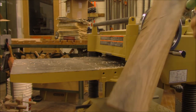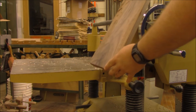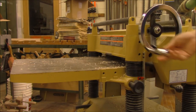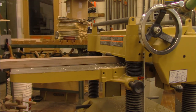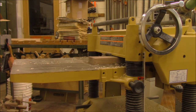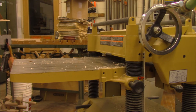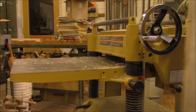You can hear and see that it mostly cut down here at this end, but we know the board was a little bit thicker at that one end. I'm giving it a half turn. Another half turn, and I'll run this again.